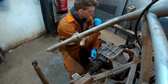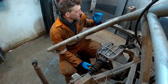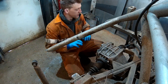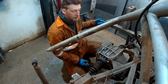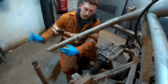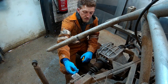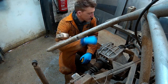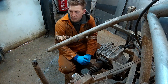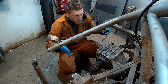First job, I've got to bring these straight throughs back out to where they need to be. I've cut this one a little short — there's a bar that runs in between these two, so I've got to bring this one out, 11 inches plus whatever I've got here. So I'm going to have to sleeve these, get a nice weld on them, pull the straight throughs out and make sure that I'm level front to back, side to side, and square.